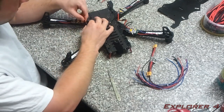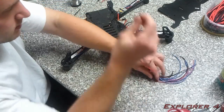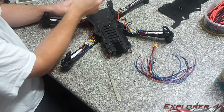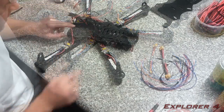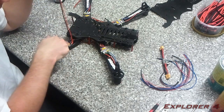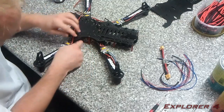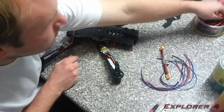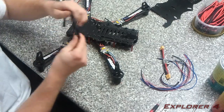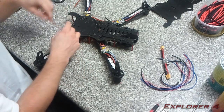The next step is to carry on these twisted wires to here, where you're then going to get another set of wires soldered onto the pads. You should have a clean bridge from this speed controller to this speed controller, and another set of wires ready to make the next bridge. I always twist the wires because it reduces interference, and I also added some braiding. You can get this braiding from HobbyKing — just cut it off with a bit of heat shrink on either end. It makes it look neater but it's optional — you can just twist and wrap in heat shrink.